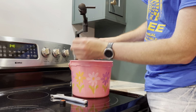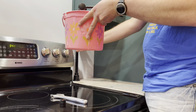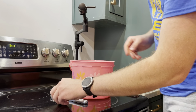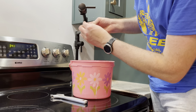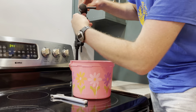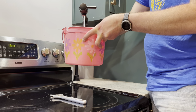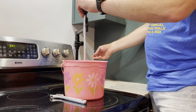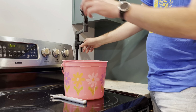There's a little O-ring up in here that just came out. Make sure you don't lose that. Alright, I've got that flushed out. I'll put the O-ring back in with the screen. Alright, and give it a try. So you have 2 shut-off valves. And vertical is off on both of them.